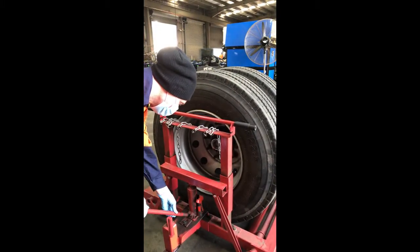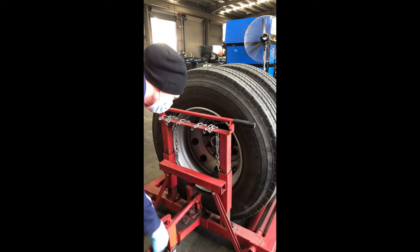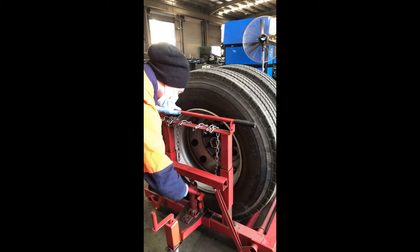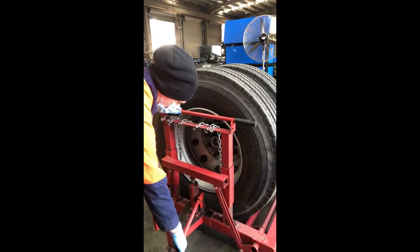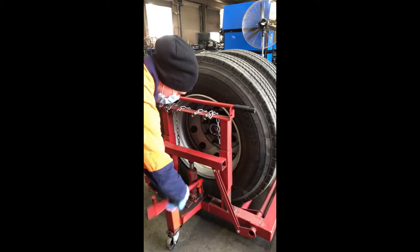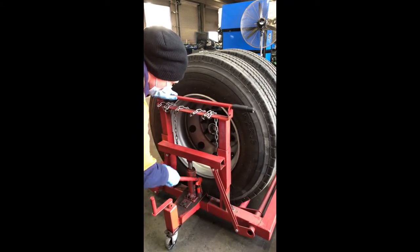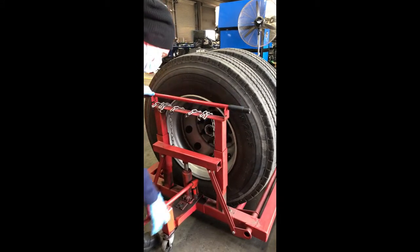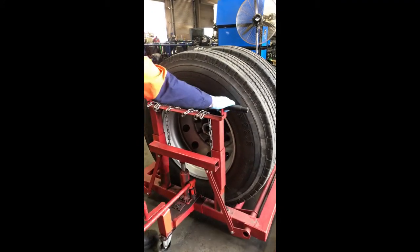By utilizing circlips in the front and rear of the hub, all the internal components are captured in the hub. This means that the Eco Plus 3 hub can be removed in one complete unit, often without removing the vehicle's tires. This means that all the internal components are protected from contamination and the bearing grease does not need to be replaced unless required.